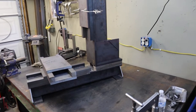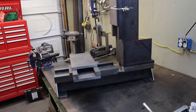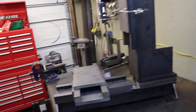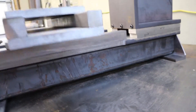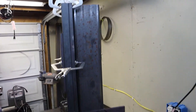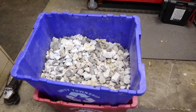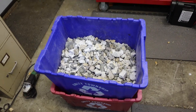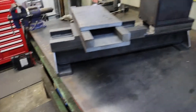The way I'm trying to combat any issues with vibration and rigidity is with the 4 by 6 inch tubing on the base and also the column — I'm going to fill them with epoxy granite. I have recycling bins full of granite that I'm going to grind up, smash up, mix with epoxy, and fill them.